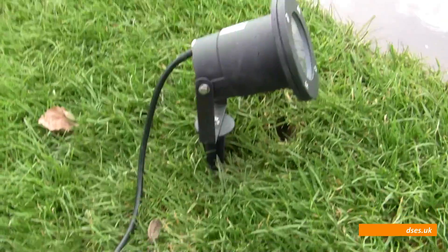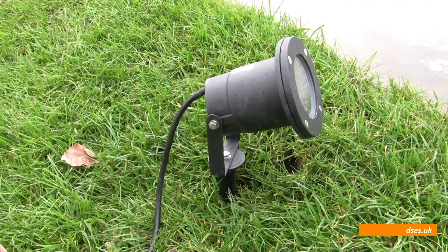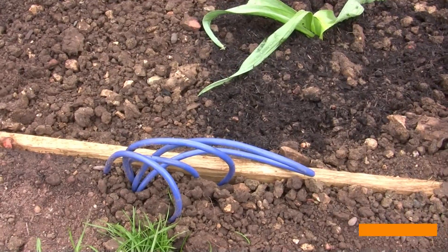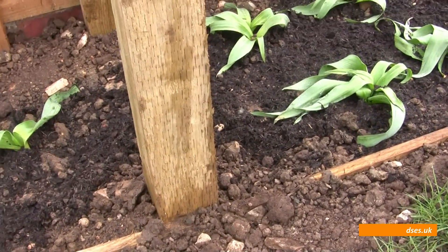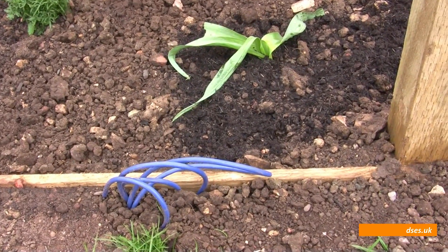I don't see the point of running 230 volt lights like these anywhere. If you do have 230 volt versions and enough space inside, what I've done before is use a little GU10 to MR16 converter — it doesn't convert the voltage, it's just a conversion of the lamp presentation, converting the two pins of a GU10 into the two prongs that an MR16 will take, allowing you to convert the fitting from 230 volt to 12 volt. Where you have cables disappearing because that's how the landscaper installed it, or even trailing on the surface around the flower beds, I think it's a bad idea because of the risk someone's going to chop into them. I don't see any need for 230 volt lighting in most places. The landscaper has left some Arctic Flex poking out the ground — it's a mains grade cable, 2.5mm Arctic Flex, but it's only carrying 12 volts. There's a loop left in case they want to add lighting along the pergola, and if that happens we'll convert whatever lights they buy to 12 volt.